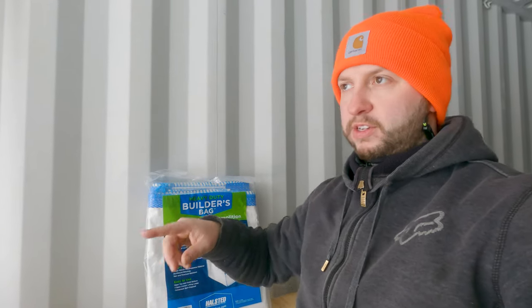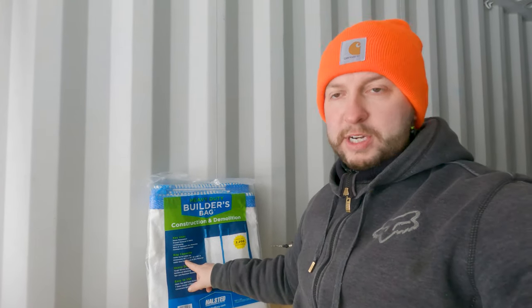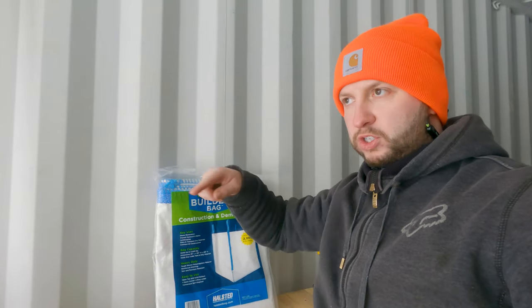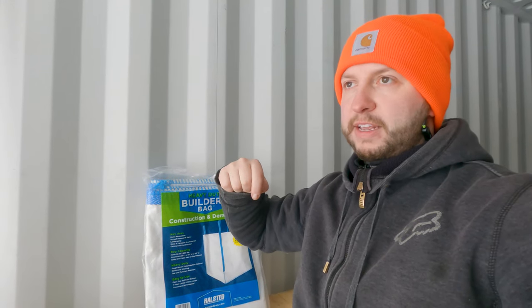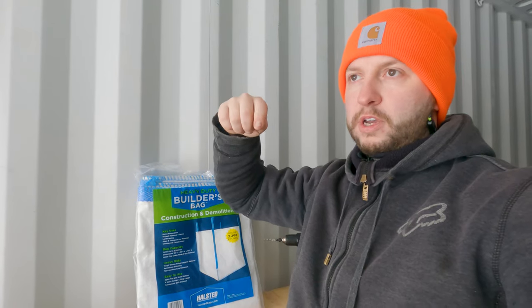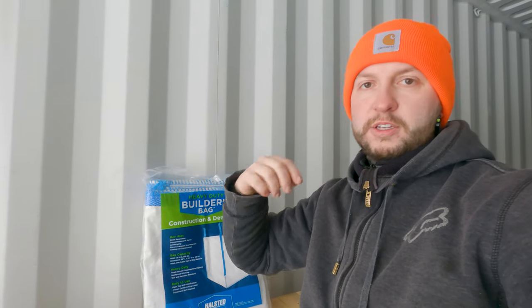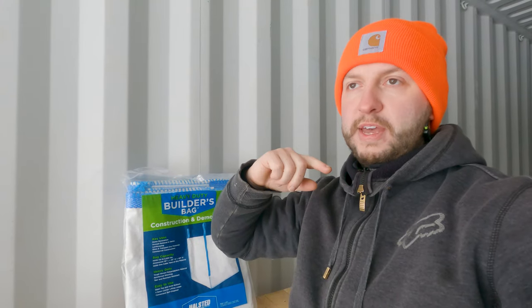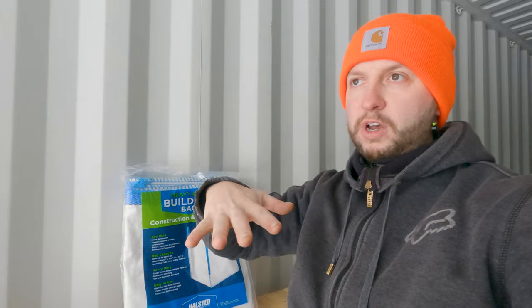The wood chips, when we fill a whole bag, the tractor can still lift them — maybe around 800 pounds if I had to guess. In terms of dimensions, these are 35 inches by 35 inches square at the bottom, about 40 inches high, and then they have handles that come off the top. My plan is to build a four-legged stand with legs that go down to the bottom with no bracing at the bottom, and a square brace at the top. That should hold the bag open, and because there's nothing at the bottom, we can use the tractor to lift the whole thing straight out.